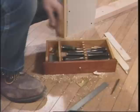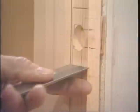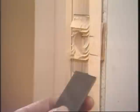I want this strike plate to be flush with the surface of the jamb, so first I'll mark the outsides of the plate. Notice that the bevel is in. I'll make a series of chips and pare it out. I'll just estimate the depth, and when I pare it I can take it down.